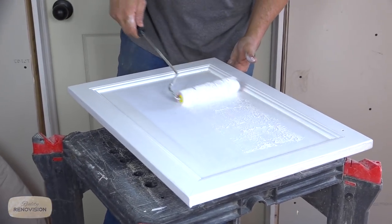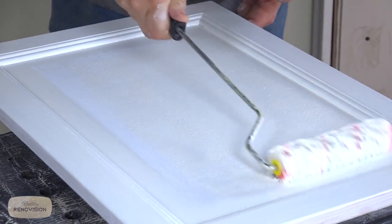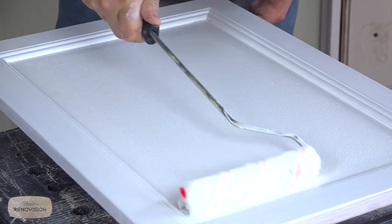Now the same thing with the door. I'm using a 10 mil roller and I didn't load up — you'll see there's hardly any paint on there. Most wooden kitchens are going to have fillers, valances, microwave shelves like this one. In most cases, at the price point that kitchens are purchased at, you're not going to get these in solid wood and stained. A lot of the fillers and miscellaneous trim boards are basically an MDF material with a vinyl skin.